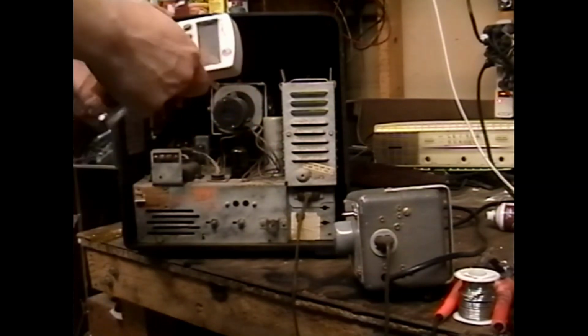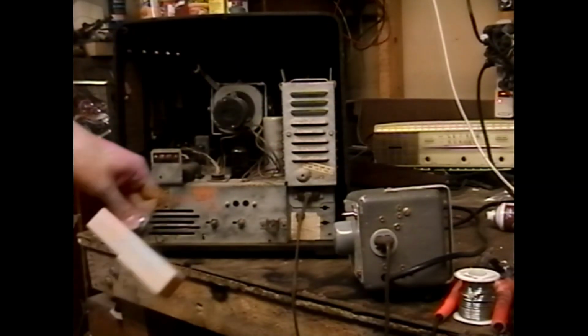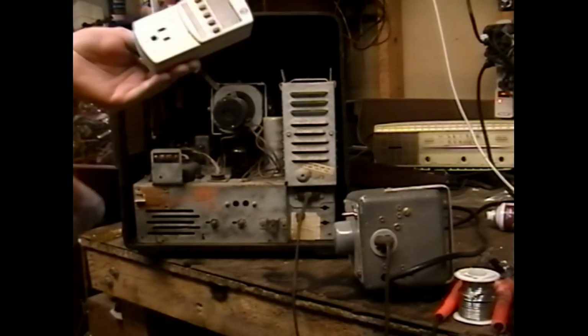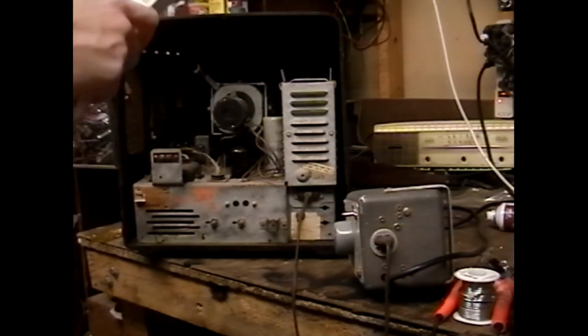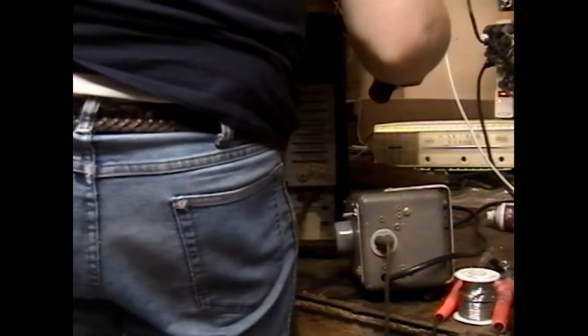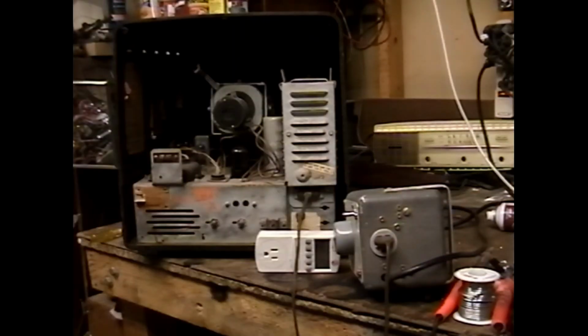At just 40 volts on the variac, it's loading this down so heavily. This is actually resetting and it won't let me switch it into current check mode. Now I'm gonna test the tube anyway, since my tester's already pre-configured. I'd like to see if there's... Oh yeah, this rectifier tube is testing shorted.